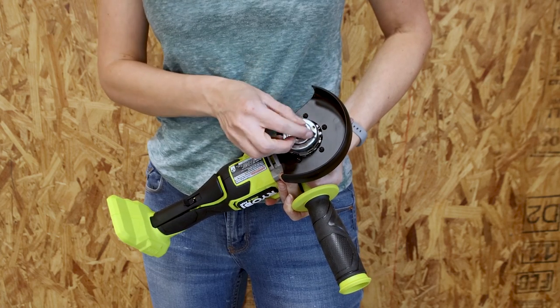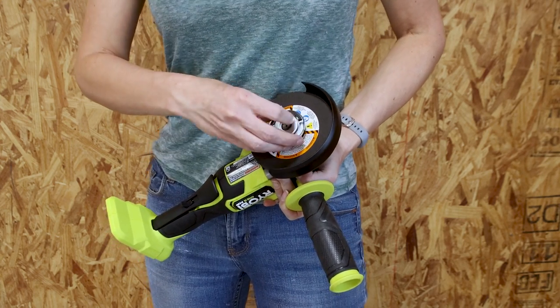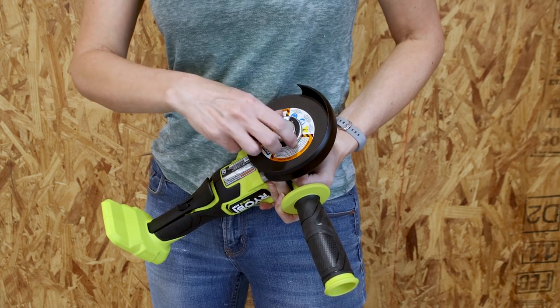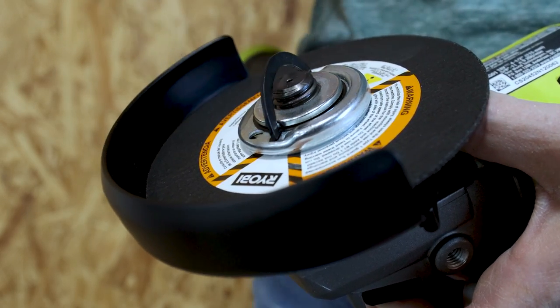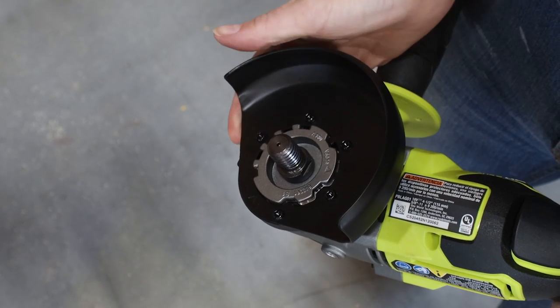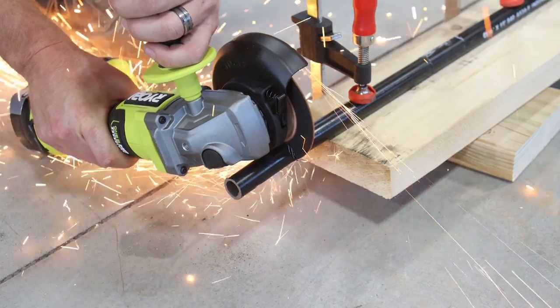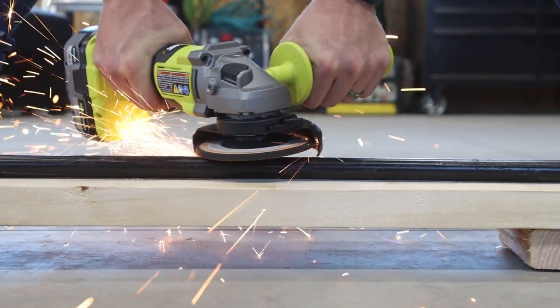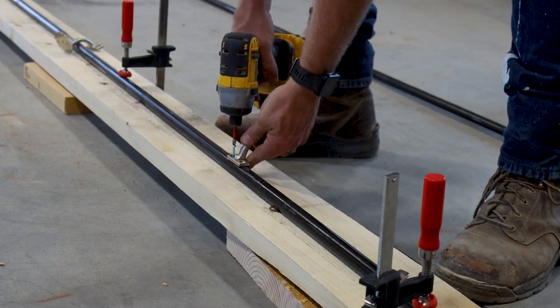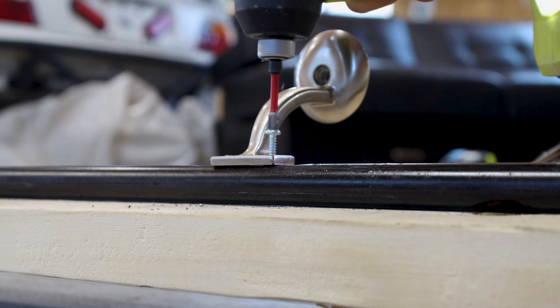This gave us a chance to try out our new Ryobi brushless cordless angle grinder, part of the new Ryobi HP line, which packs the long lasting power of a brushless motor in a smaller, lighter weight compact package. Ryobi included upgraded design features like tool-free wheel and guard adjustment for quick and easy changes. Once the one inch black pipe gas line we had selected for the rail was cut to size, Bryce used the angle grinder to grind a flat spot every three feet so we could mount standard heavy duty handrail brackets — the type you can easily find in the hardware section of Home Depot to mount a wood handrail to the wall.